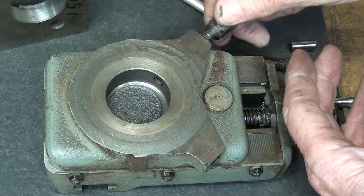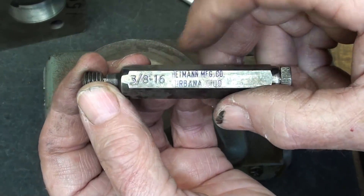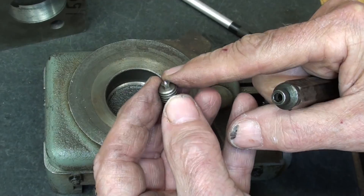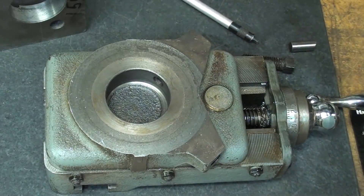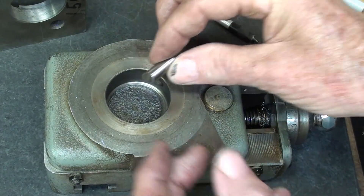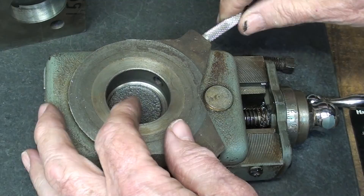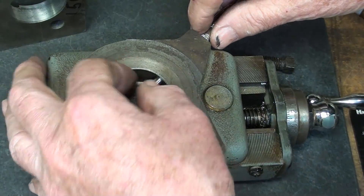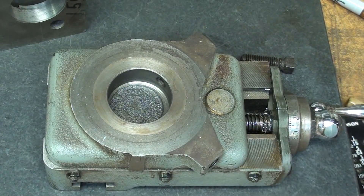I need to take the time to repeat something here on these transfer screws — this is a large enough size so you can really see what I'm talking about. It's a Hyman. They come in every size. It's one of the greatest inventions ever conceived by mankind — tiny little punch there, with a little socket wrench — it's just perfect to transfer holes. This pin here — they're hardened, and I think that's 45 degrees. Using a magnet, you can see these go all the way in. These are 5/16ths in diameter, probably made from hardened dowel pins.